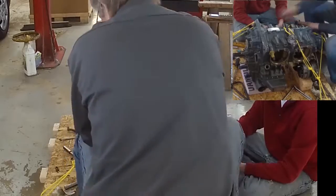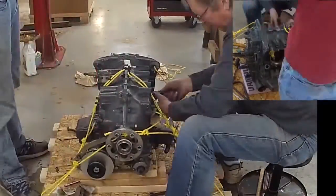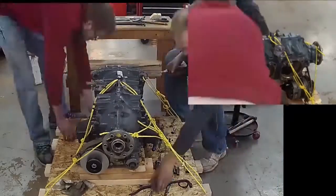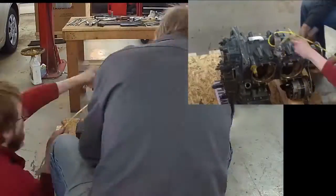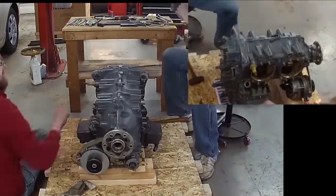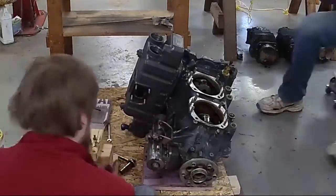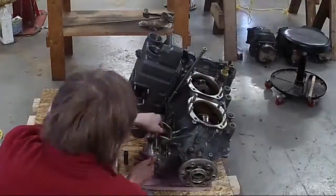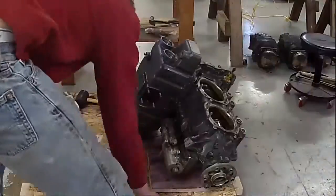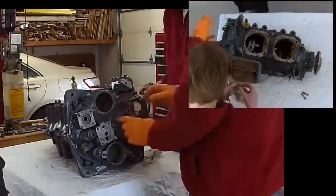Somewhere around here I start working on the through bolts — I stacked up the little spacers that come off the through bolts, put a wrench on them, and used the bolt to pull the through bolts out. You can see them coming. Got a couple of the ropes off now for a little better access. Now it's time to rotate. I took the top through bolts out — the quarter-inch ones — and got it on its side so we can start taking off the accessories on the front bottom of the engine. Meanwhile I was pulling bolts off the accessory case, helped Mike with the fold-over locking tabs on the starter, and then the bottom came off pretty fast, giving us a lighter weight object to move over to the better work surface.